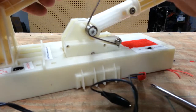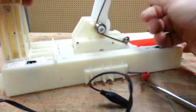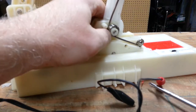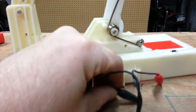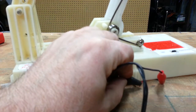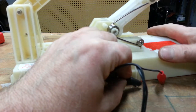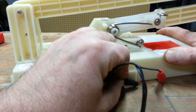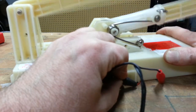Here I've put the gearbox back into the base and put one of the springs back on to show you how this mechanism works. All I need to do is add 6-volt power to the motor and it will ratchet back the mechanism until it reaches the bottom, then it will jump up. If you keep the power connected, it will just do this over and over again. The limit switch told the brain when to stop the motor, and the sensor or foot pedal would tell it when to start again.